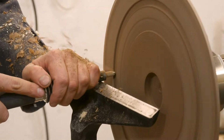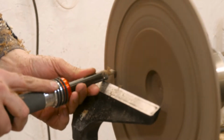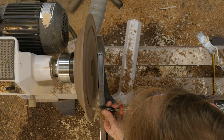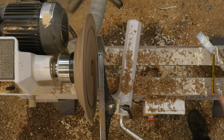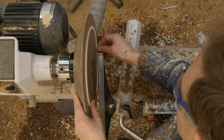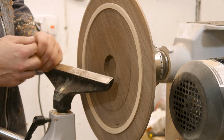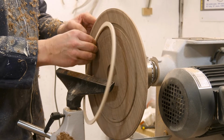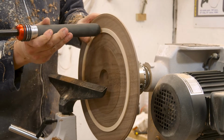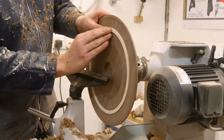Remember to do your taper. And now it should start to go in much deeper. Pretty good. Don't push it in too much because you won't be able to get it out before gluing, okay? So I can tell that that is pushing in very nicely. And if we tapped this with the back of the handle once the glue is on, then it's going to be correct. Yeah, looking good.